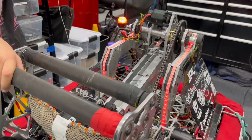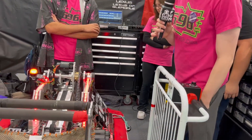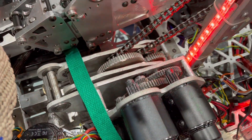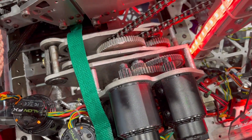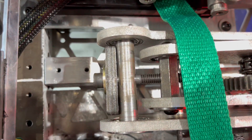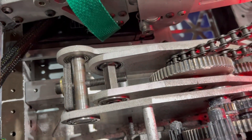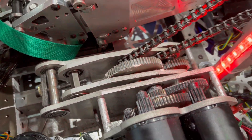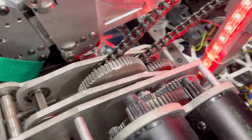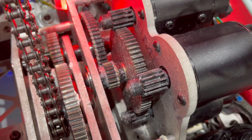Last up, we're going to have Oscar take us through the pivot. They've got a really neat-looking custom gearbox going on here. So during Houston, we had a lot of problems with the chain tension. We realized we had to redesign the entire tensioning system — before, it was just two screws that would push the entire gearbox over, and that really did not work as they came undone. So we switched to this screw, which pulls down this whole arm here and lets you tension a lot easier. The screw stays in a lot tighter. We had to size up the screw from the original design, which actually broke an axle. We also added an extra motor from our Houston design to give it more power and be able to hold up the giant arm that it swings a lot easier. So it's become a lot more stable and maintains tension throughout the match — we've had almost no problems retaining tension throughout even whole competitions.